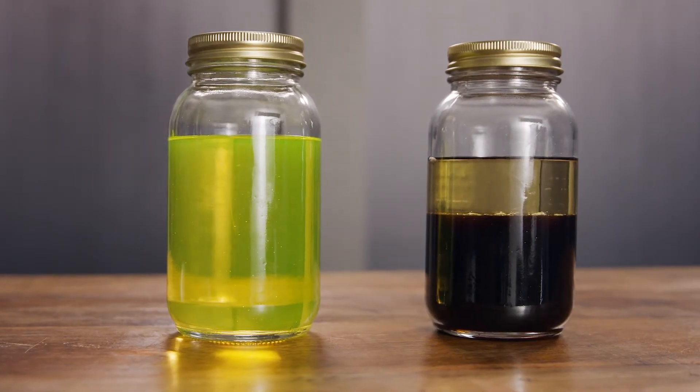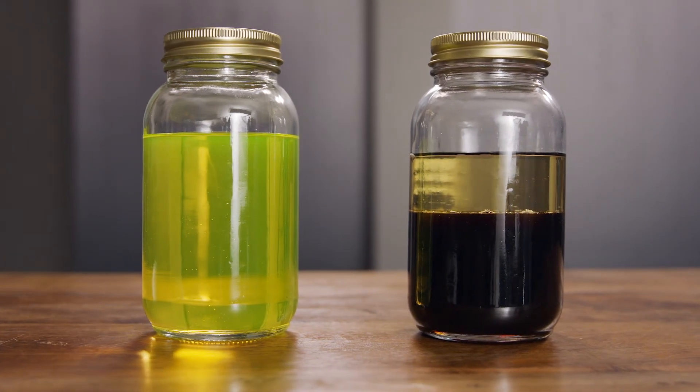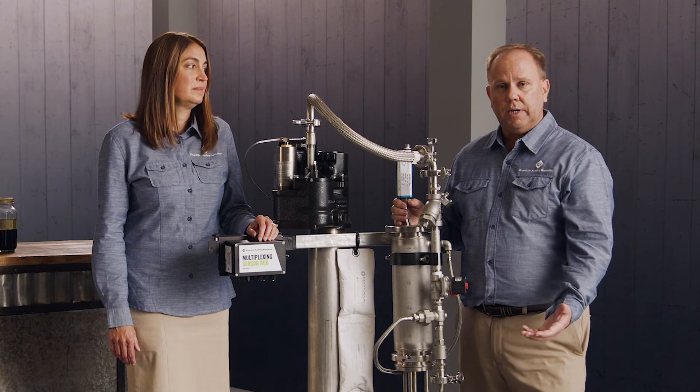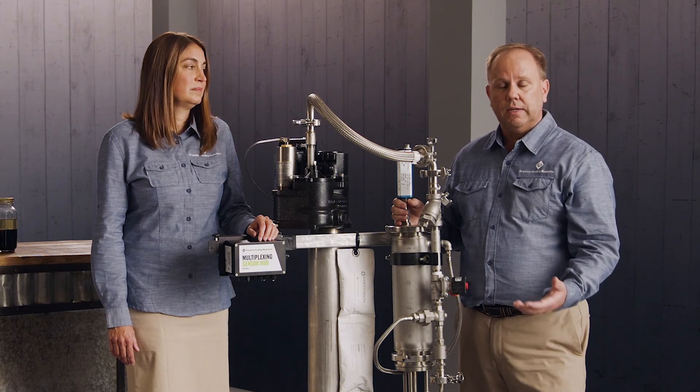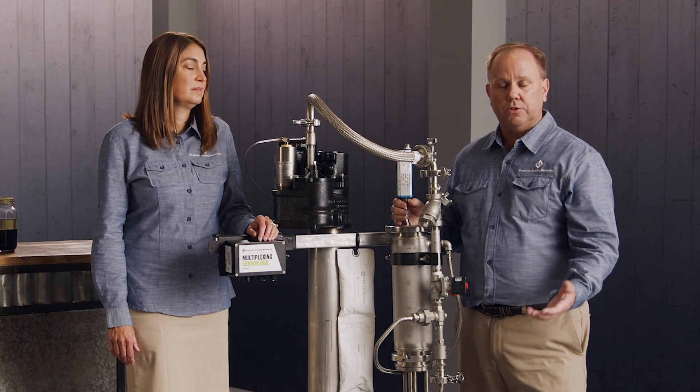As part of our development, we pulled samples from the bottoms of underground storage tanks in diesel applications. What we found was that if we can eliminate the water, we can eliminate the microbes from thriving. Thus, we can eliminate the acid and the accelerated corrosion that's related to it.